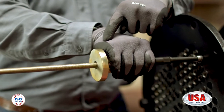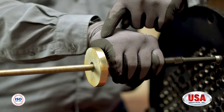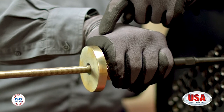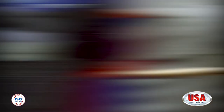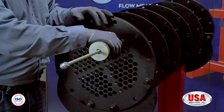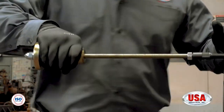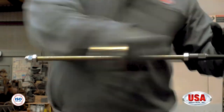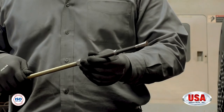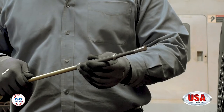Remember when you are doing this to have the back or fat part of the hand on the back side of the slide hammer. The reason being is that it will cushion the blow while you are forcefully pulling it back, keeping you from harming your hand. You also want to make sure that no one is directly behind you or nearby so you do not hit them with the spear or slide hammer. Now you can see you have removed the pin from the ring and removed the entire Snappin Plug from the ID of the tube.